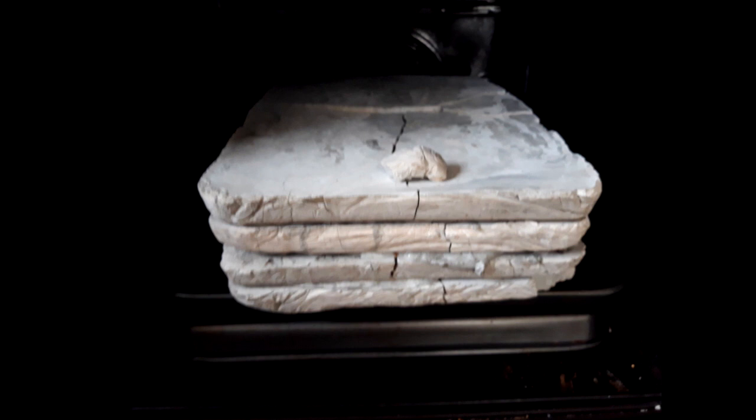Press the other baking sheet down on top of the molten plastic until level. Be careful the washers don't fall out. Then set the other 2 pieces of channel iron on top, and rest the 8kg brick on top of the channel iron. Leave it in the oven for another 20 minutes, still at 180°C. The channel iron is doing the same as before — preventing the baking sheet from bending and ensuring even heat distribution.